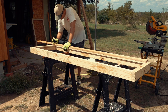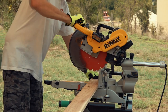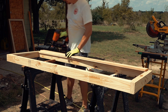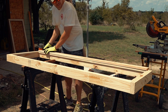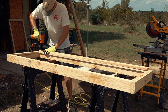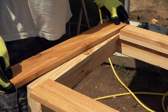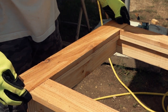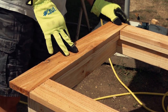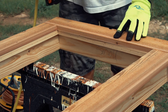So that means I have to cut it right here. I'm attaching this one with staples — these are 16-gauge, a little bigger and longer, at one and a half inches. Look at this — this is the leftover piece, the one I just cut off, and it's a perfect fit. I don't need to cut it. It's not too long, it's not too short — it is a perfect fit. If I had planned this, it would not have worked. And this is the last one; then it's ready for painting.